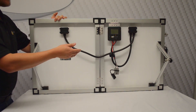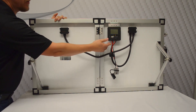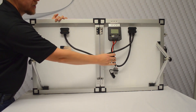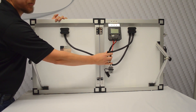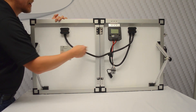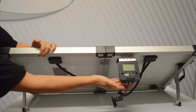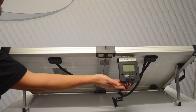Taking a closer look at the back side of the panel, I wanted to show why we have our PWM 10 controller on a swivel. I also wanted to mention that we have a 10-amp inline fuse on the battery connection to protect all the wiring. As you can see when we lay the panel down, we can bring the controller out so we can see how much current is going in and what the battery voltage is at any given time.